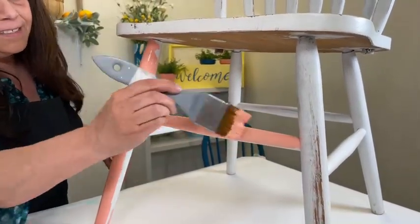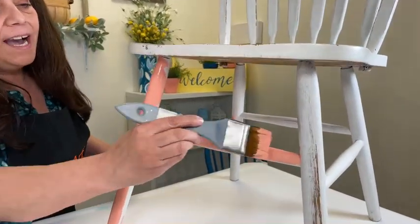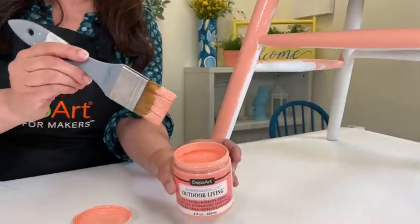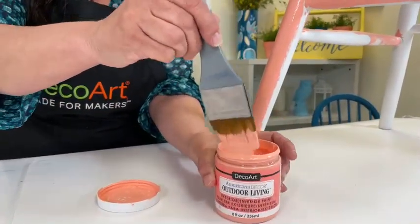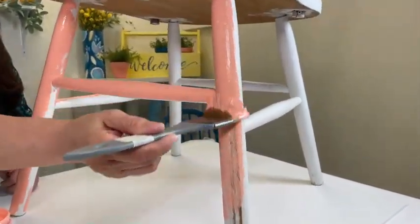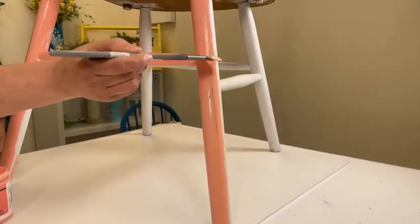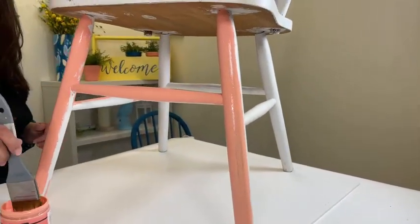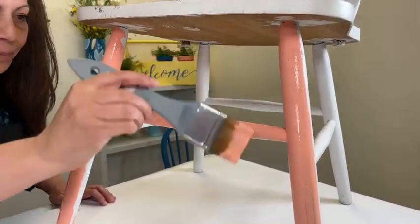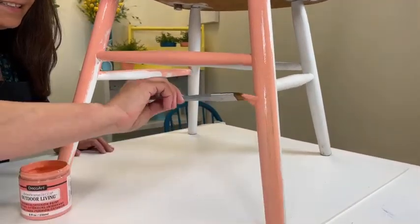I did start painting this before the difficulties, so I'm starting again. I'm using a flat soft brush, and because these jars have a nice wide mouth you can just dip your brush right in. I want you to see how nicely it covers. Another great thing about this paint is I did not use any type of primer because it's not necessary. You do want to wipe down your furniture piece to make sure it's not dusty or dirty so the paint has good adhesion.